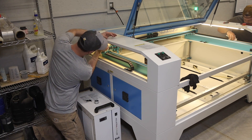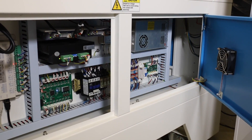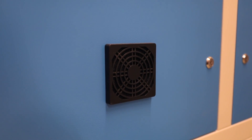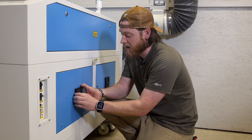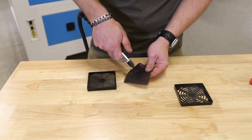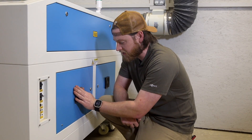If you see electrical components inside a panel you open up, do not get anywhere near them with your damp rag. Another few places to clean are the filters for all the electrical panel fans — there are four on this unit, two on each side of the machine. Simply grasp the little plastic cover and pull it off. There is a felt-type filter on there that you will need to blow out with compressed air, then wipe it all off and clean it.